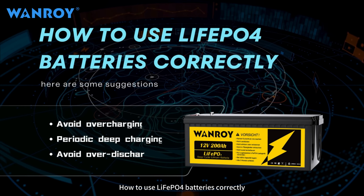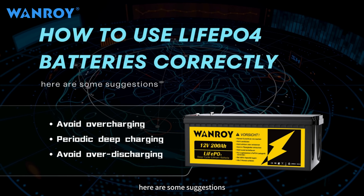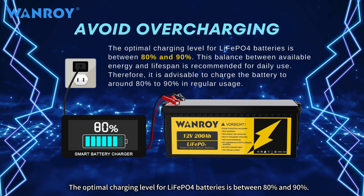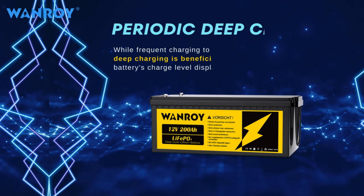How to use LiFePO4 batteries correctly? Here are some suggestions. Avoid overcharging. The optimal charging level for LiFePO4 batteries is between 80% and 90%. This balance between available energy and lifespan is recommended for daily use. Therefore, it is advisable to charge the battery to around 80% to 90% in regular usage.